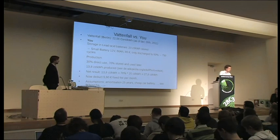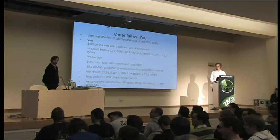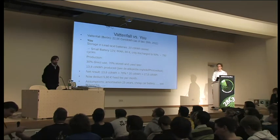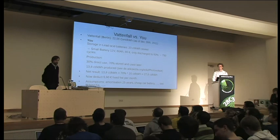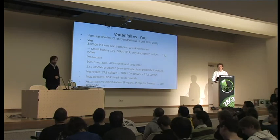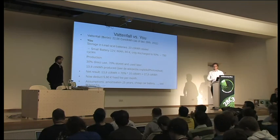There are quite a few assumptions in here. Okay. There's a question. Microphone, please. Is there a difference between a car battery and solar battery? There are technical differences, but for the easy assumptions, we just took car batteries. Car batteries are optimized for some other usage because they have to stand the cold and have to have the big currents to start the car, which you would not need for solar batteries, but they're priced too high. So we took the very cheap approach. There would be better batteries for that purpose. Yeah. Car batteries will break earlier, but they are dirt cheap, so use them. There's another question, isn't there?